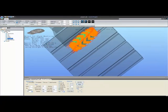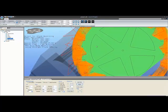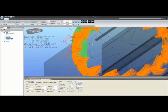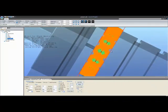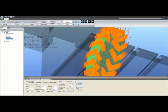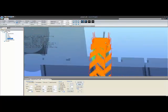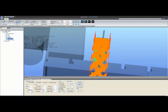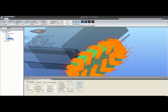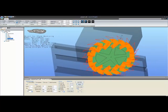And if you look at a herringbone, you can see from above anyway the helical shaping. You can see the routing and so on, and the roots are pretty good, what we have selected and so on. The center, however, is not going to give you a nice sharp corner due to the roundness of your cutting bit, so you're probably going to end up having to put a herringbone onto your lathe and spinning down a little groove in the middle to take care of that sharpness. This is one reason that herringbones are a little bit hard to build.